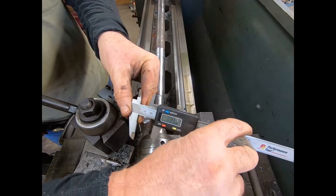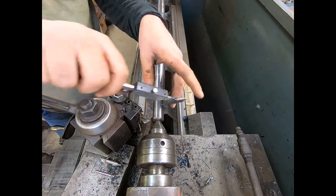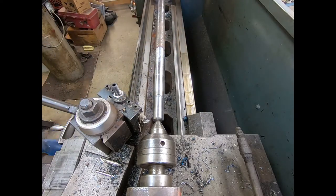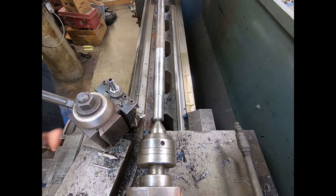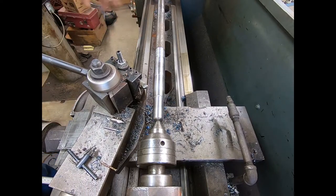This should be about 9.95 — that's 9.96. I'm good with that, and that's just with a set of calipers. I need it down a thousandths, but I don't, because this is going to be squared off. The actual round surface doesn't even do anything — it's just getting it down close. So we're going to reverse all of our stuff, shut you off, and flip this shaft.